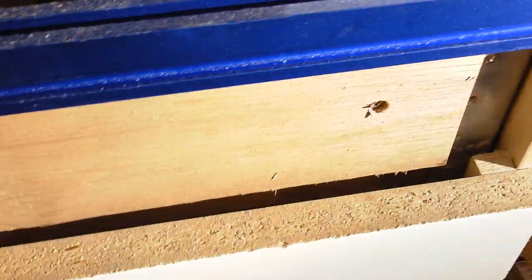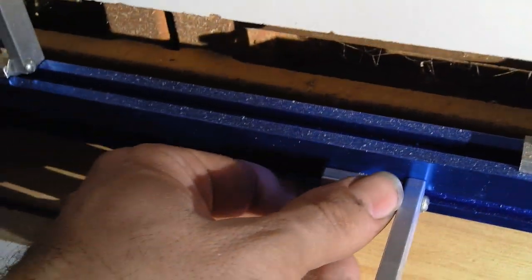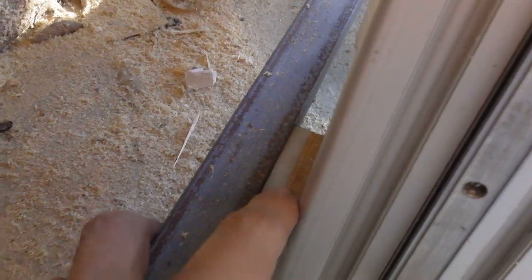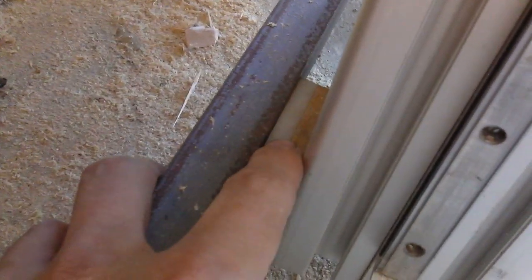There's the stop system with these little flip stops I made, in two positions. These upper ones will be set-and-forget stops, and then there are a couple lower ones for regular moving around. I haven't had scales there yet. This is a metal rail down here that's just a piece of angle iron tapped into these metal things. Wood could be used for these parts at the base too. There's also a piece of UHMW — high density plastic — that I MacGyvered to get the beam parallel to the working surface of the plane, so the saw cuts straight in all three axes.